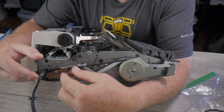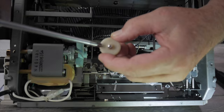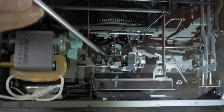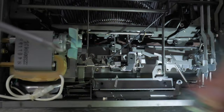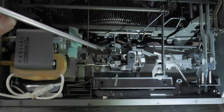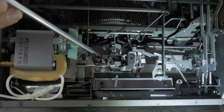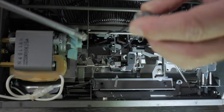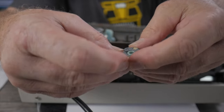This little thing here is the tabulator brake. The gear on the back engages the main sprocket of the escapement, and it has centrifugal-operated pads that spin out and slow it down — they are engaged all the time. I went ahead and did some test typing without that brake in place at all and I'm still seeing a little piling on of letters when rapidly typing, so I don't think the tabulator brake is slowing down the carriage.